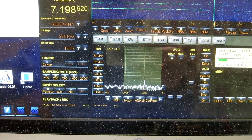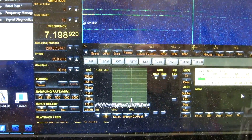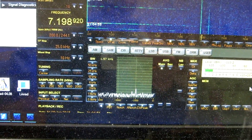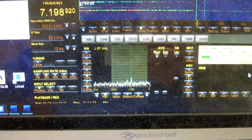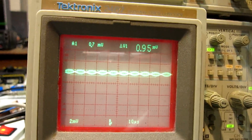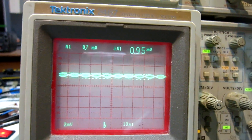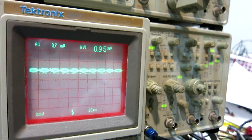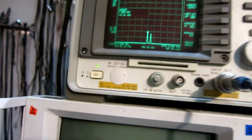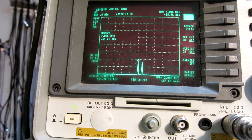I continue upwards and it disappears, so it isn't intermodulation. This is digital feedback. The signal looks like this — it's about one millivolt peak for the combined signal, so both signals are half a millivolt, or according to the spectrum analyzer it's minus 63.5 dBm.